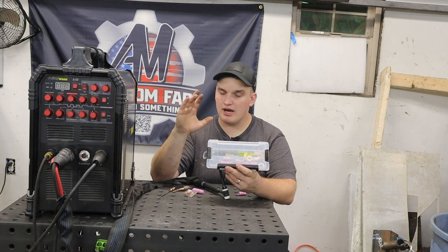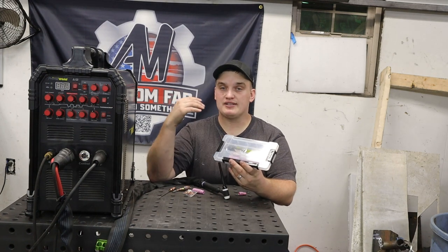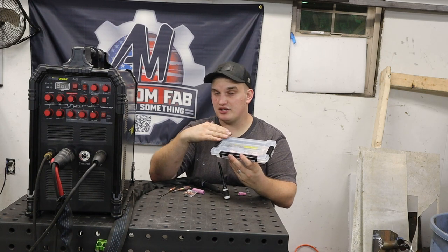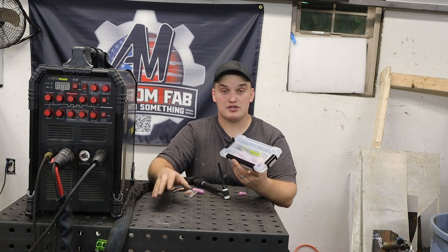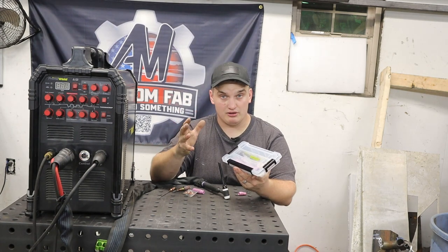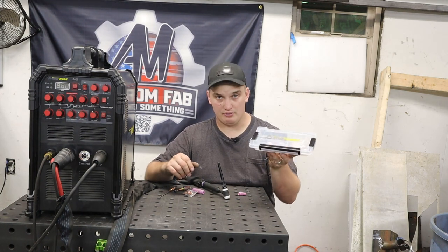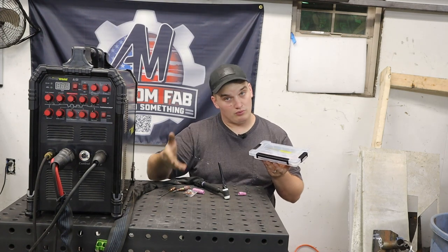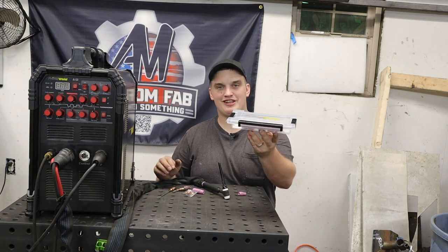This PrimeWeld kit, at the time of this video, is right around $65. Now in my opinion there's a tiny bit of downside to this kit personally, because 90% of what I do I'm going to be using 3/32. So buying this kit, I might use the 1/8 inch, but I'm probably never going to use the 1/16 inch — I'd just be buying things that sit in the drawer. The most common size you're going to use when starting out is more than likely going to be 3/32, unless you're welding some thicker aluminum. These are quality consumables — I've tried them and I would stand behind them. There is some appeal to getting the back caps with it, which you do not get with the kit from Weld Metals Online. So it all depends on if you want to start very budget around $25, or if you've got a little more budget and can get the multi-piece kit.